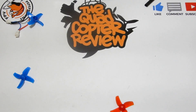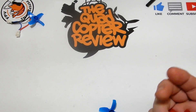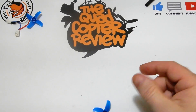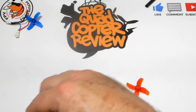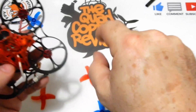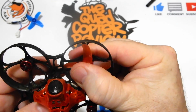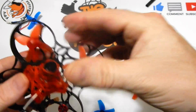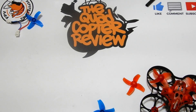Another viewer mentioned there should be a piece of foam in the package to take out the slack in the 1S batteries — I personally didn't get one, but these were early production units. I'll try to source better props. To recap prop orientation: the fat side faces outward when the prop is vertical. Same on each corner, and remember these run caddy-corner — take a left-front style prop and put it on the right-back position.